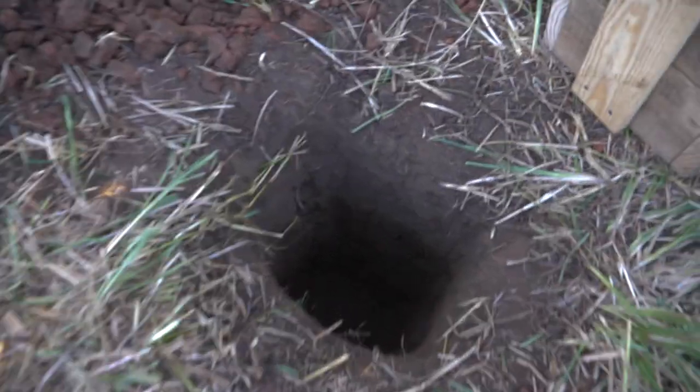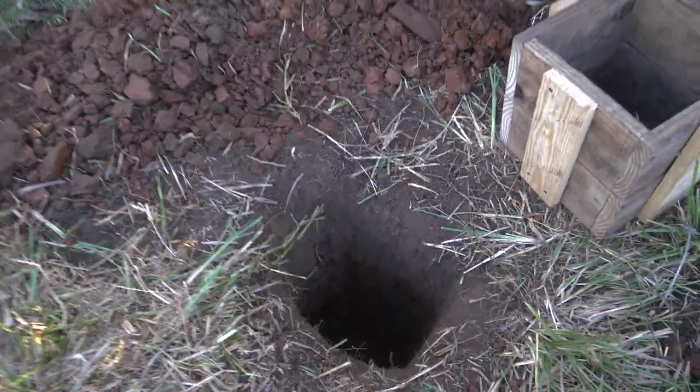That ladies and gentlemen is a hole. The first hole has been dug. That took me about an hour, a little bit over an hour. It's two feet deep and the box is coming over it, and basically I'm pouring that full with concrete. It takes longer than I thought — much longer. It's also a little bit too deep to do with just a shovel. I know these pole diggers — it's a different tool and that's definitely useful, especially for getting the material out of the hole. Right now I'm on my knees grabbing it out of there. I should have bought that. Maybe I need to go back to civilization and get that tool because I don't want to break my back over digging these holes.